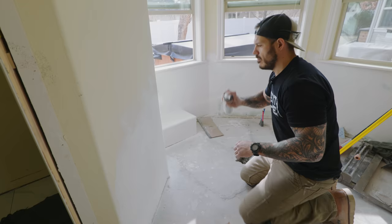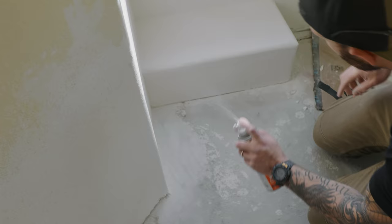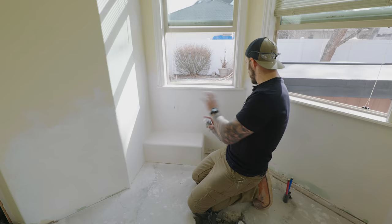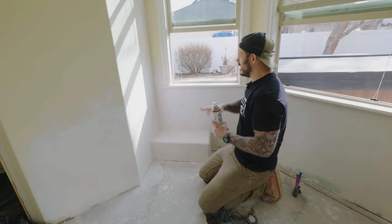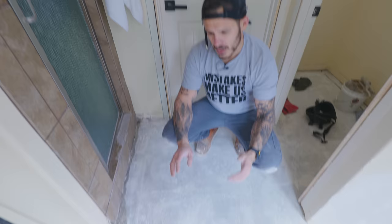This is orange peel texture — set it on medium, shake it vigorously as the can says, and hold it one or two feet away in a circular pattern. My experience is that when you put too much it gunks down, so go on the lighter side and add as it dries. I'm not going to do this wall because I had inspiration to remove all this trim and make a really wide wainscoting kind of built-in trim — a little more grand, a little Victorian style.